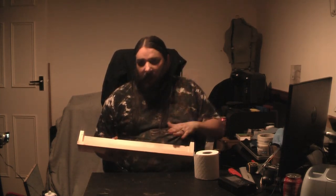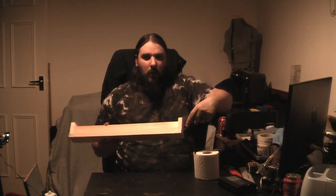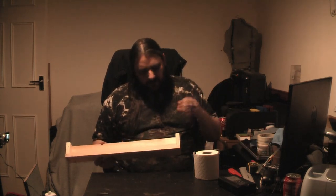For mold releasing, if you're taking things out of the mold, having those kind of curves does help a bit. Dead straight 90 degrees is not so easy because the piece can lock itself in there with the resin once it's cured. So it's swings and roundabouts. We don't want a death load of silicone in here because we're going to do a mold release anyway, so we're going to keep it nice and simple. You only need enough silicone just to bridge that gap. It's almost like making a gasket for an engine.